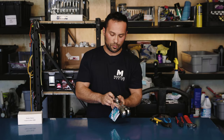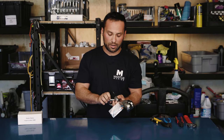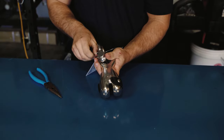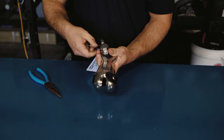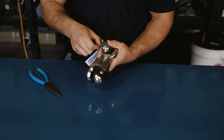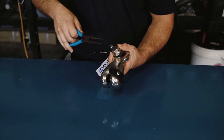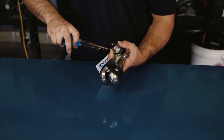You're then going to wrap that wire around the body of the shackle and back to the head. You can do this in a figure-8 or a circle pattern. You'll run those wires back together and give them two or three twists to lock the wires in place.